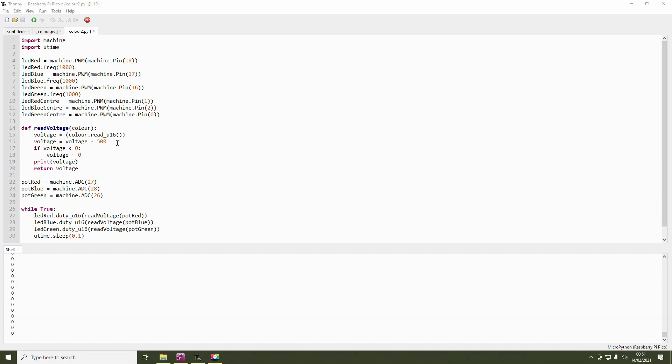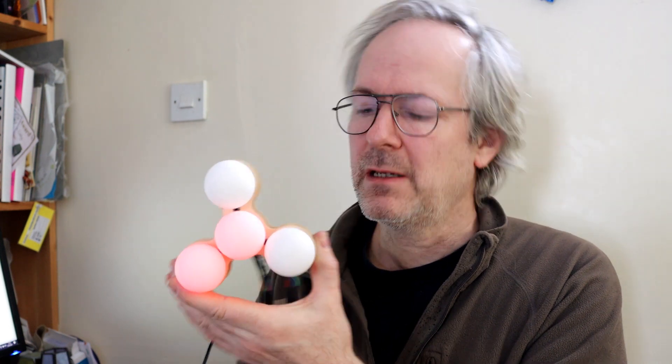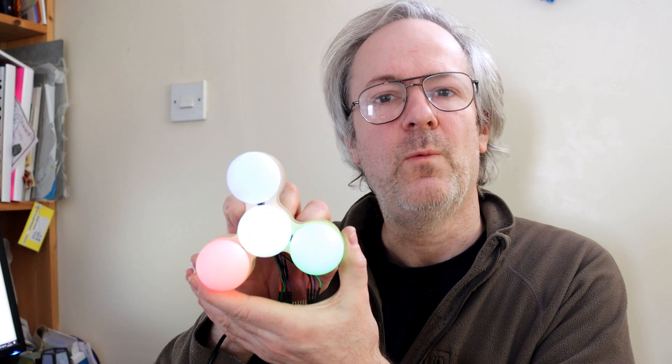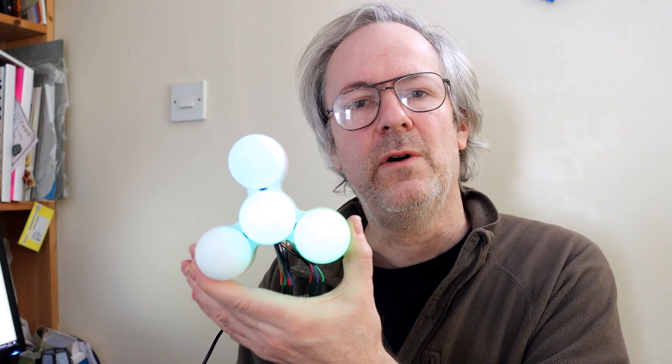So returning to my program, you can see I've reduced the voltage bits by 500, and that's got rid of this offset. But obviously that's going to result in quite a few negative numbers, so I've just done this if statement to return them to zero if they go below zero. And that has resolved all of my problems. So I've had a little play with the program and it's now working correctly — and I've found out why it wasn't working correctly, which is always useful. So just to show you how it works: you just add a little bit of red, and maybe add a bit of blue and you get a nice pink. And then add a bit of green and you get a white first, and then you get a pale green. And then you basically just play with the colors and see what they combine to make. So that's my little first Pico project — thank you for watching, and please subscribe.